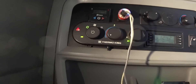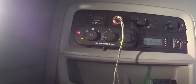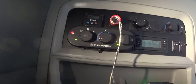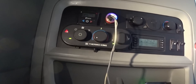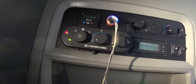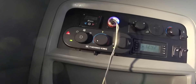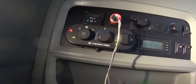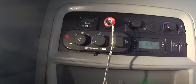Let me show you guys — here's my panel back in the sleeper. You can see I have a red triangle and ACS is lit up. The APU will run for a little while, fans will kick on, but it never cools. I've been checking fuses because in the past this happened and it was a fuse — I think it's a 10-amp fuse — and the recommendation is to put a 25-amp fuse in. I did that and the fuse is good.